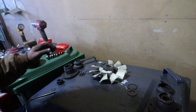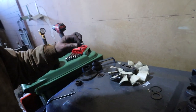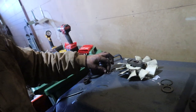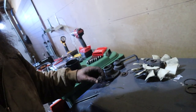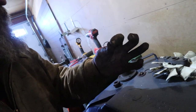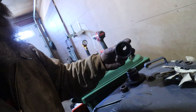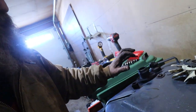Here's what I have so far on the bench: this is the one that has a spring in it — this is the part closest to the back of the tractor, and this is the good one. There are four little balls, and those four little balls go into these little holes — four little holes. Then here's the little clip that held this piece on, and then this is the good rubber coupler that went over the top to make sure no bad stuff got in there. The fan was also at that end.